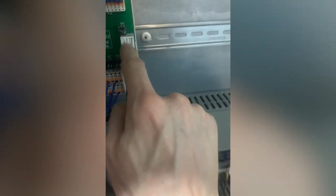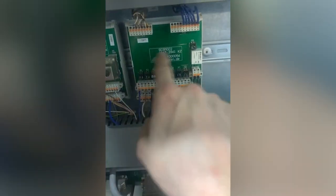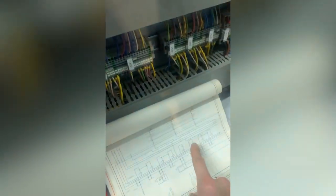So now I just need to see if this master relay is working, or is that what's suffering from the vibration? Because last time I was here, rattling this door, messed this up also. That's still in fault. So have I got a problem down here? We're getting there, but yeah, this is something you've got to watch out for, because this has got goodies hidden within that could mess up your testing, although in this case, the drawing looks complicated.